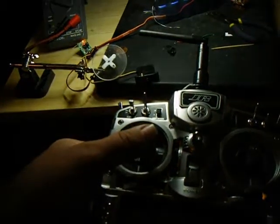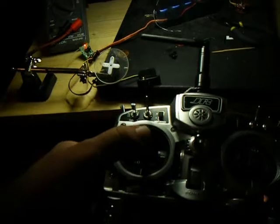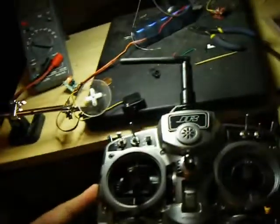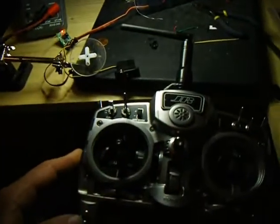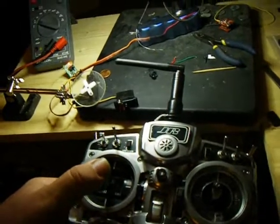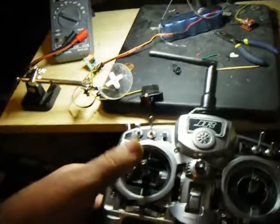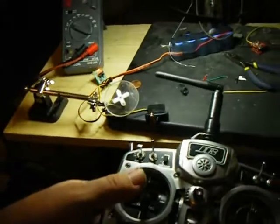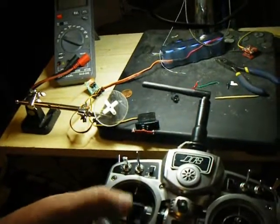So it's pretty straightforward. I did have to set the max speed of travel, and I've had to set a bunch of expo and travel adjust on the radio. But that's all. It's pretty straightforward once you play with it, and it's undoable too. All I have to do is replace the main output gear on the servo and solder back in the wires to the position sensor, and it's all back up and running. No permanent changes — so that's kind of cool.